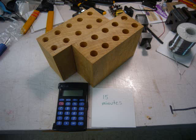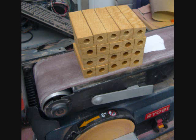The first step is to cut the wood into 4-inch long pieces. I bore them out using a drill the same size as the bore of the instrument through the straight tubing section, in this case 0.459, which was exactly what they advertised. I cut those sections up on the bandsaw into rectangular blocks and pre-round them with the disc sander by eye.